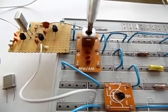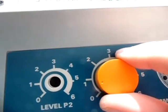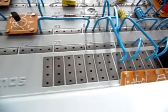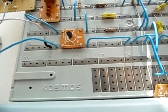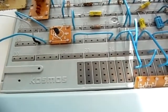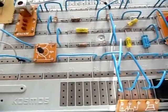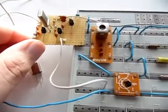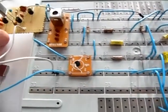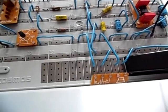I'll turn it on — and we can hear the station. Let's tune it in and decrease the volume. Obviously it's working. I don't want to play too much as I'm not sure about copyright, but as you can hear, it's working. With different crystals you can pick up different ranges from the shortwave band. With a 27 megahertz crystal or around 27.5, I'd have to calculate it, but you could probably even pick up the CB radio band. This makes your Cosmos radio receiver into a shortwave receiver — and it even changes its name, because it now works as the basics of a superheterodyne receiver. This circuit is very easy to build, as you'll see in the upcoming video. This is my expansion to the Cosmos radio circuits, and I've also tested it with the X1000 — it works there as well.